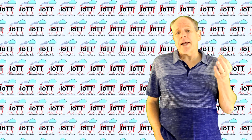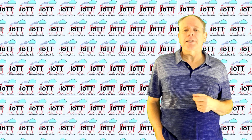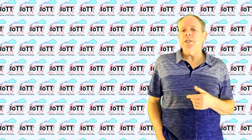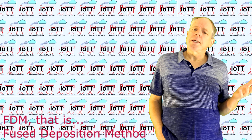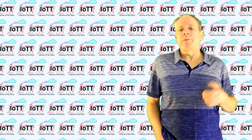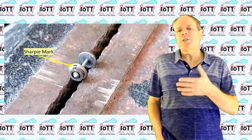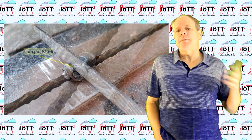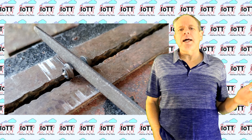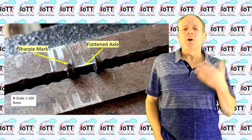With such a small size, those magnets are too tiny to mount them using the same method I used in the case of the G-scale axle. Printing a magnet holder with the precision needed would be very difficult using a FDM 3D printer. Using a resin printer might work better, but unfortunately I don't have one. So I tried a simpler approach: I marked the wheel flange in two opposite locations and placed the axle on a vice with the first mark on top. I then took a small file and created a flat spot on the axle, just wide enough to place the magnet on it. Then I rotated the axle 180 degrees, used the marking as orientation, and created a second flat spot on the other side of the axle.